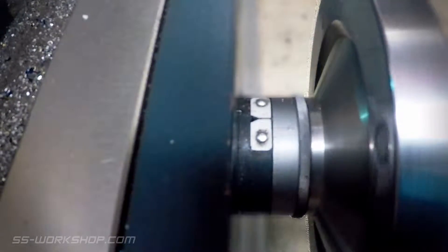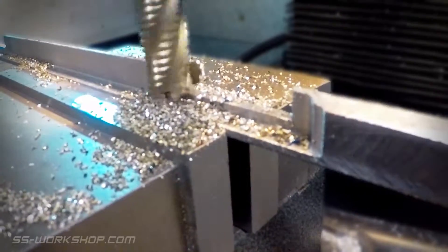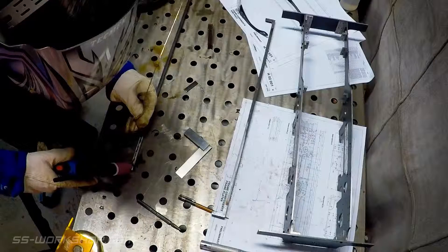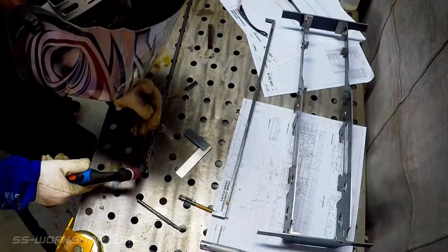At this point I could remove the excess material from the centre of the bar, leaving tabs at either end. I then TIG welded 3mm steel plate extensions onto the remaining tabs to form the final height.